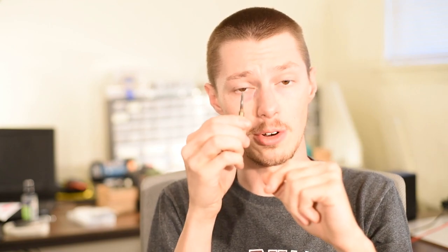Basically this silicon nitride tip here, I don't know how well you can see it, but it's an insulating ceramic encapsulant with tungsten carbide heating elements in it. And between the tungsten carbide heating elements is a more or less empty silicon nitride section. If we can drill a hole right through the middle of this, all the way out the back, we could feed wire down into it and use it as a very fast hot end.